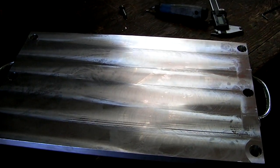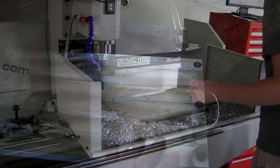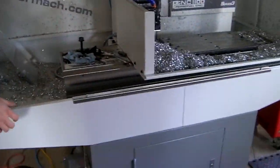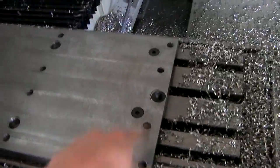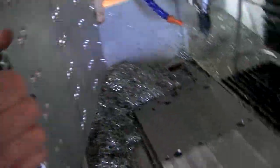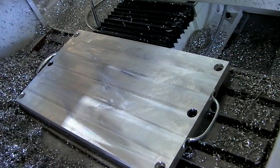We're going to do the same thing to this one — notice how it's already surfaced, super smooth. I'm doing a separate video specifically for fixtures and pallets, but Eric's going to show you how it goes on. Notice how it's got two alignment pins right there and there — they stick up from the surface an exact distance apart, and there are threaded bolt holes. This is my steel sub plate, and the pallet goes on top. Notice how handy the handles are.